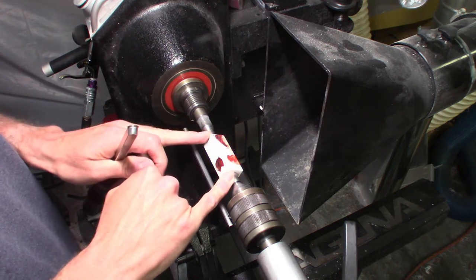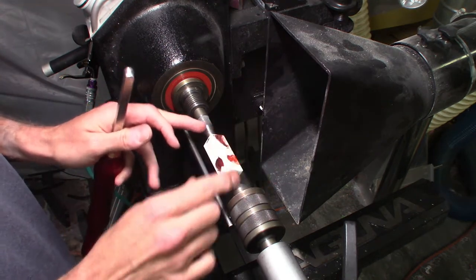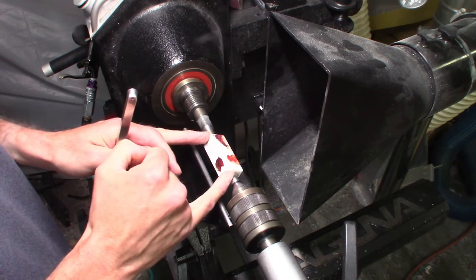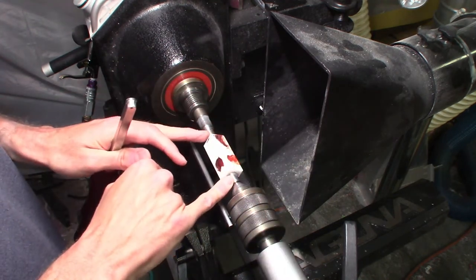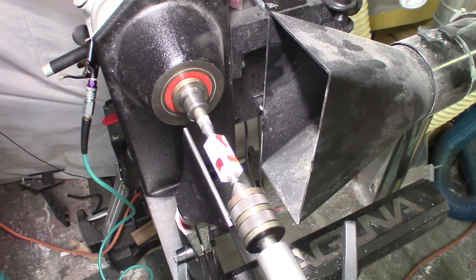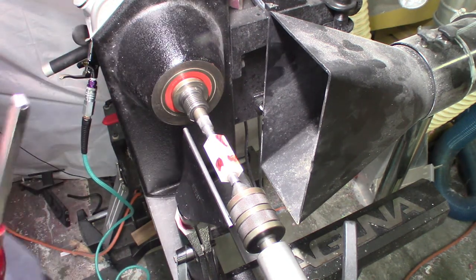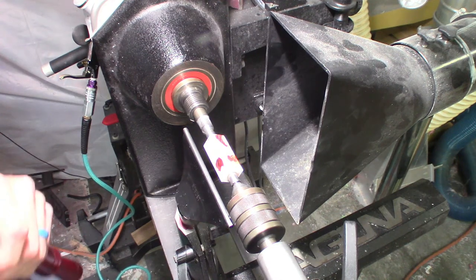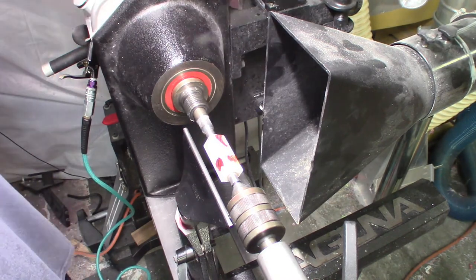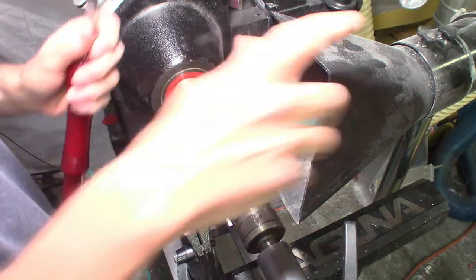Again, the most precise way to go, for kits that you turn a lot of, like a Sierra or cigars, I would recommend getting a set of the TBC bushings if you're going to switch to this method. Then just use the adapters on stuff that you don't turn a whole lot of. That way you can save some cash here and there. The adapters are great. The only issue is you have to have the bushings. If you don't even have the standard bushings, then they're kind of useless.